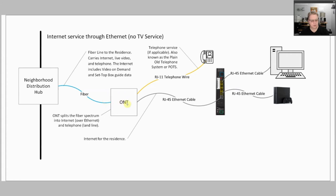Newer versions of Fios installations, or if you have internet service that's 100 megabits per second or more, will almost always use an ethernet cable, because the version of MOCA being supported by Verizon doesn't actually support 100 megabits per second ethernet. The MOCA standards, at least the newer ones, do support that, but the equipment from Verizon is of varying ages and most of it doesn't support the higher speeds. So to be consistent, they just switch to using an ethernet cable for higher-speed connections.